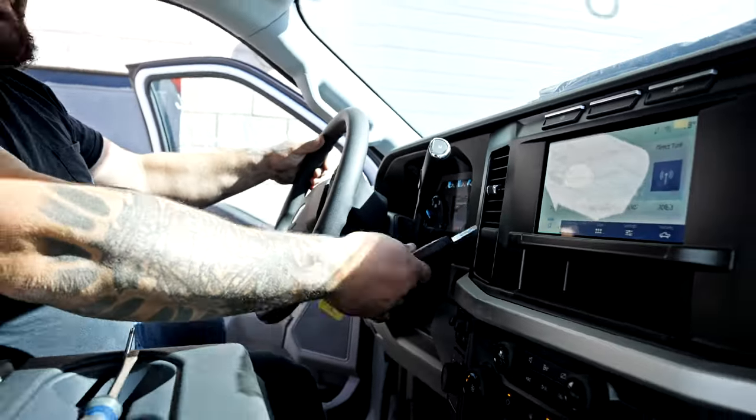From there, also, if I was to take the ignition out, I just turned the key off, I pulled the key out. Truck's still running. As long as the upfitter switch is in the on position and the generator's engaged, the truck's gonna continue to run. No one can steal the truck though, because I have the key. You can't put it in gear, you can't take the brake off, nothing.